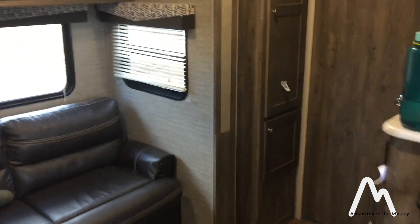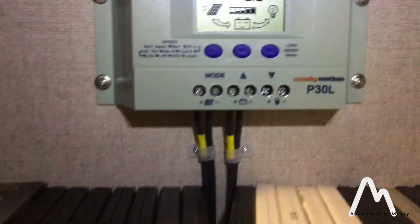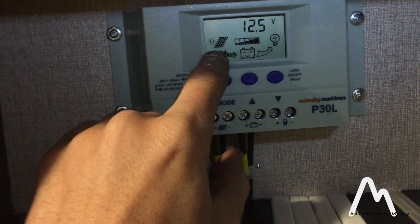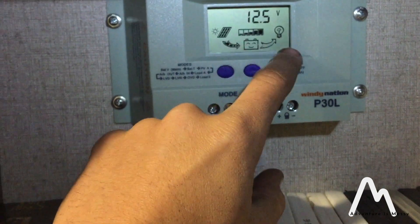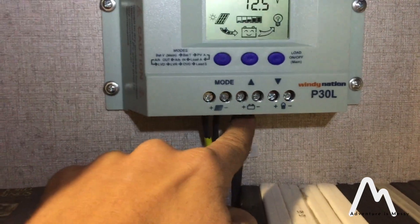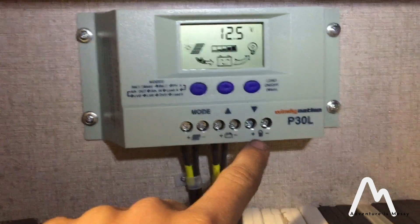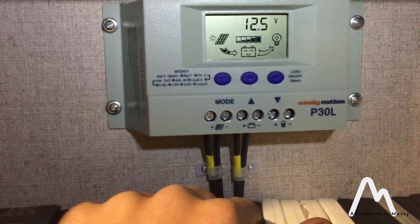All right guys, inside the rig here — I'm going to show y'all. This is the cabinet that I used to drop all my wires through. I really liked it because it went from the ceiling all the way down to the floor. Up there is where I dropped the wires down. So I have my positive and negative coming from the solar and they go down through here, then right up to my charge controller. There's my charge controller. What it's saying is that I have solar power coming in, my batteries are sitting at 12.5 volts, and I don't have anything going on my load. This is my positive and negative from the solar — these go up to the roof. These are my batteries, positive and negative. And this is my load, which is optional — in case you want to run something directly from the solar panels, which I'm not doing. I'm only using mine to charge my batteries.